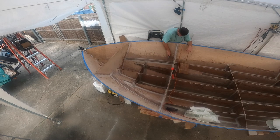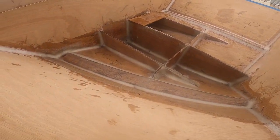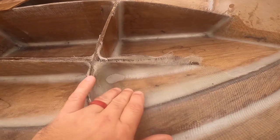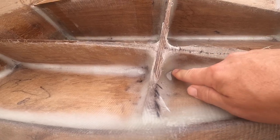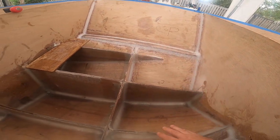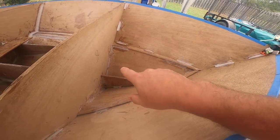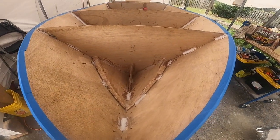This is all what we got done yesterday — got all of this in here and it looks pretty good. I can see a little spot right here where I had a little too much — this little pocket of epoxy is still a little soft, probably where everything just drained down in there. That'll be all right. Got all this done and about to tackle compartments C2 and C5 — same thing. Once we get done with that we're going to jump on this next one. We've got to wait for some more Cabosil to arrive to do the thickened epoxy in here, but that should be here in the next couple of days.